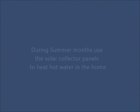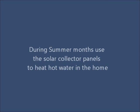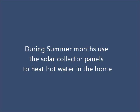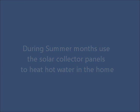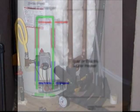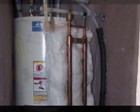One great use of this system in the summer, when the floor heat is no longer required, is to route the heat to your domestic hot water heater using a heat exchanger. Controlled again by two manual zone valves, the incoming heat from the collectors now supplies free heat to your water heater. What could be better than that? This is a seasonal adjustment that prevents the system and your house from overheating in the summer.